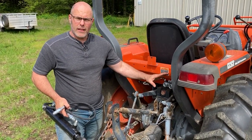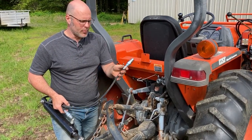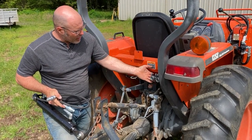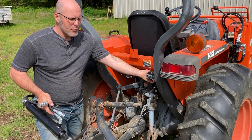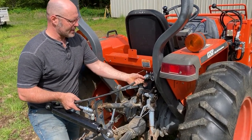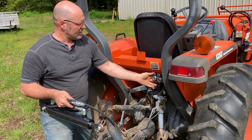Installation of the hydraulic kit is basically complete, but the last thing to do before you call it totally done is to grab one of your quick couplers that comes with the kit and make sure these connectors are able to connect. You just shove in to connect the quick coupler, pull out to disconnect. If we've got any sort of problem, it's often because the hoses in the back of these couplers have to slide about three-eighths of an inch, and if you've got them bound up against something, they can't push in to allow the coupler to grab. So just shove in with your coupler — it should slide in just like that. Test that with both couplers.